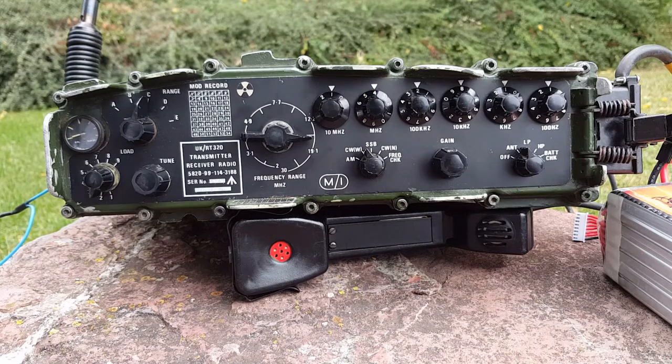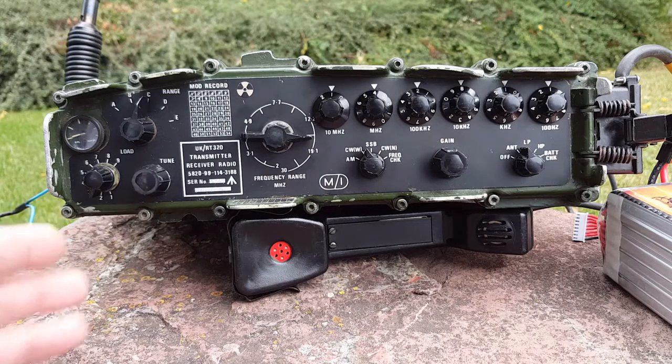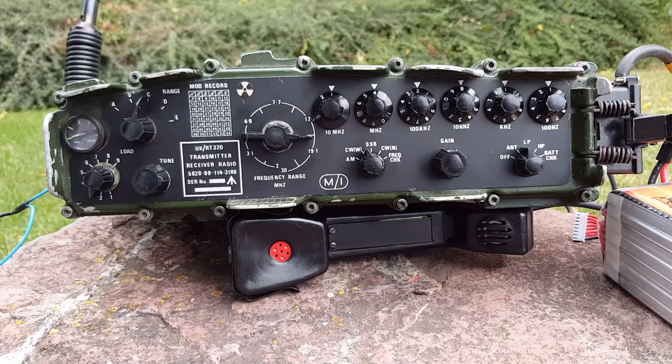Another con is that a radio like the RT320 is an excellent radio, but it's old. The capacitors start to fail after about 30 years, so it's not going to last another 30, that's for sure. Something's going to happen before that. Mine is okay, so I'm sure it has a few good years left, and usually you'll get some warning signs, like variations in frequency. So I don't think they would fail dramatically, but still, you're going to start having problems.